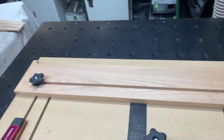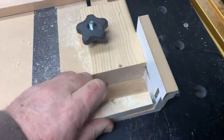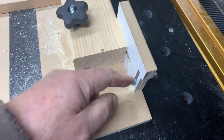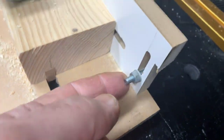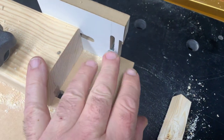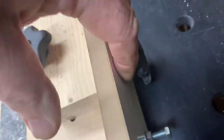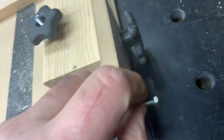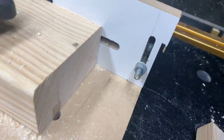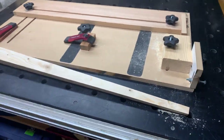I utilised an existing carriage which I've already got, so I didn't want too many jigs as I don't have much room. Down on this end, if you unscrew this, it can reference back and forth — so depending on how big I want the end to be. This bolt here has a double bolt arrangement and can slide up and down to find the centre, so you can make this to your own requirements. I cut the slots using my Domino, which was great — I just put it on the wider setting and kept moving it along, instead of getting the router out.